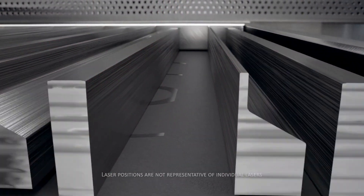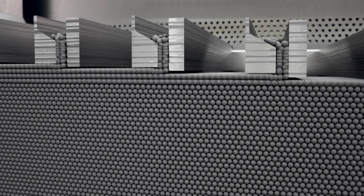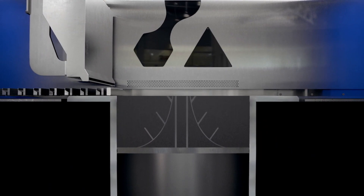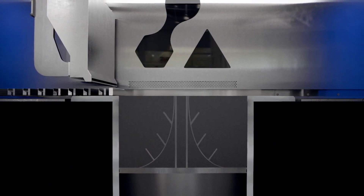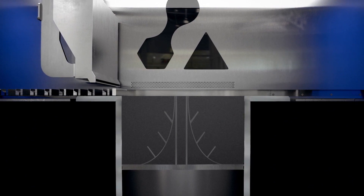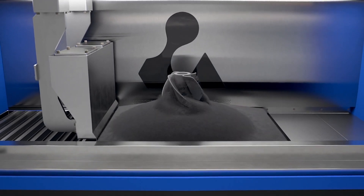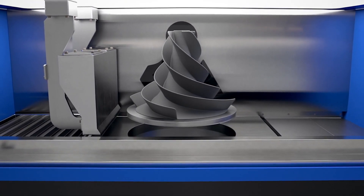As the first layer is coated with powder, the lasers activate and melt in the workspace provided. That work area is then immediately re-coated with powder and the following slice of the model is melted. This process repeats as many times as there are gates in the gantry, until the entire gantry is swept across the build surface, combining powder coating and lasing into one sweeping movement across multiple layers simultaneously.